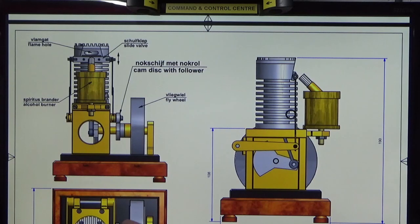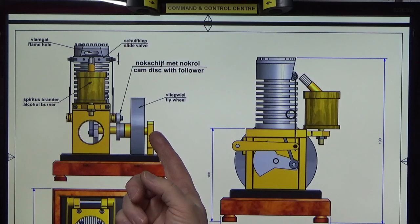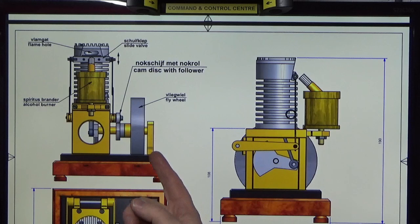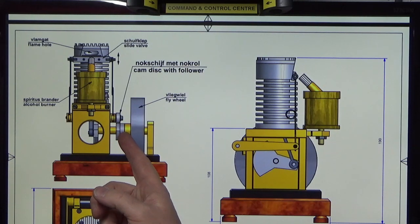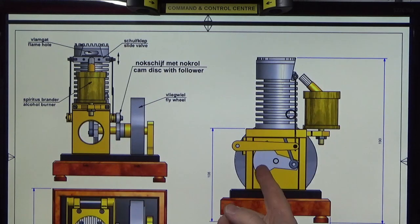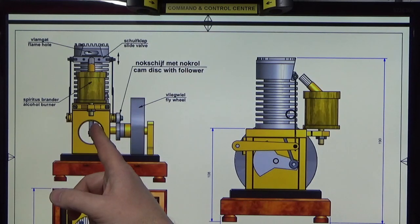Right then guys, we're up at the screen. So what we're talking about here is the shaft, the crankshaft that runs from this end bearing journal in this support here, all the way through the flywheel, through various spacers, through the cam itself, and that's part of this episode, through some more spacers into the back of the crank web, which you can see here, and then the crank pin that's pressed into that then drives the conrod up and down in the cylinder for the piston.